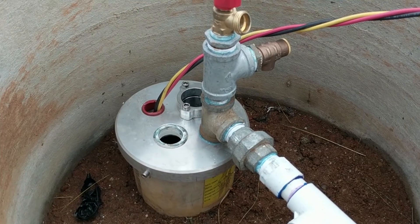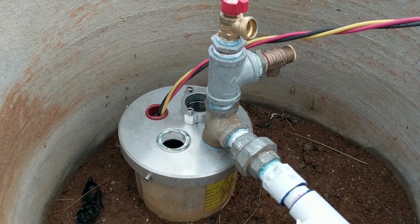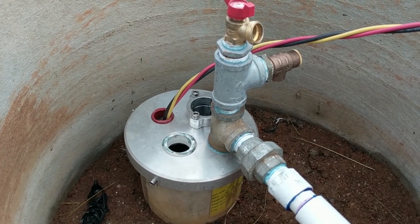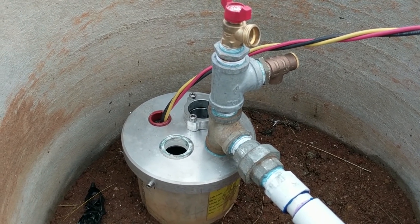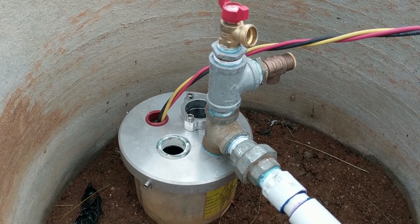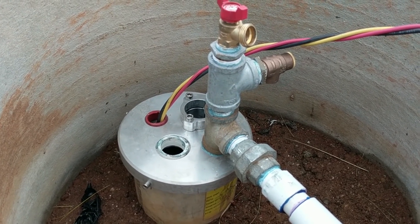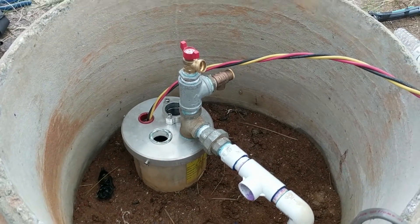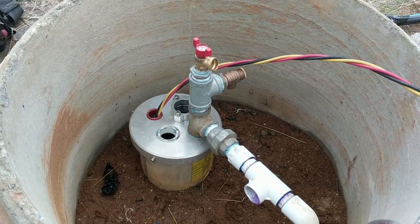You might be wondering why. The dimming of the lights — when this pump surges, I think it's right at 31 amps — it causes a little dimming of the lights, and it's not hurting anything. Again, it's an annoyance. So I offered the customer the opportunity to add a soft start pump but leave his existing pump in there. If it ain't broke, don't fix it.